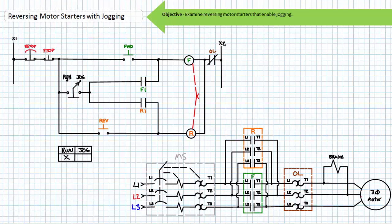Similarly, with the selector switch in the jog position, if an operator were to press reverse, the R contactor coil would energize, the primary R contacts would close as would holding contact R1. However, due to the open selector switch in the jog position, the holding circuit is not maintained. The electrically released brakes would disengage and the motor would begin spinning counterclockwise as long as the operator held the reverse button closed. As soon as the operator released the reverse push button, the spring return would return it to its deactivated open state and de-energize the R contactor coil. The primary R contacts would open as would auxiliary contact R1. The spring-set brakes would apply and the de-energized motor would be brought to a rapid halt. With the selector switch in the jog position, an operator could press reverse until the shaft or applied load is in an ideal position, then release. The motor would jog to this position and the spring-set brake would keep it there.